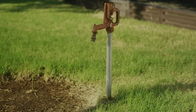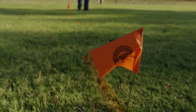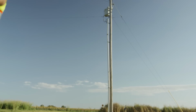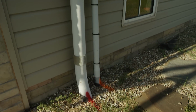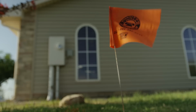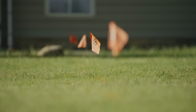Check for information about existing or planned structures, elevations, or proposed work that may be taking place at the same time. Inspect the job site for evidence of utilities, slopes, soil type and conditions, and obstacles such as buildings, railroad crossings, or streams you may have while trenching. Use the correct tools, machinery, safety equipment, and work methods. After you have gathered all the necessary information, plan the proposed excavation.